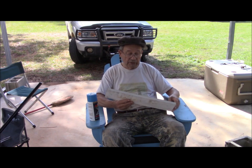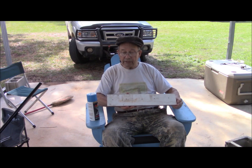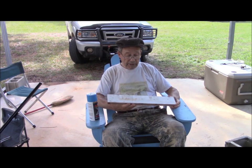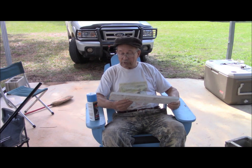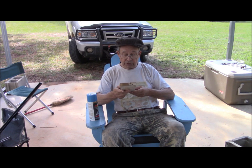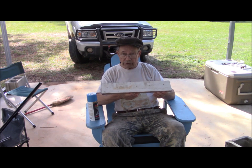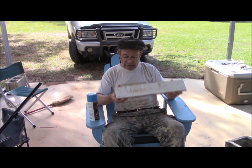What you haven't seen is that the original owner had the back of the chair split, and he replaced it with a piece of 1x pine — but it was too thin for the job and would not support the weight, so it split as well. This has now been replaced with a 2x4 and longer and stronger screws, so there's no reason to believe that this will not hold indefinitely.